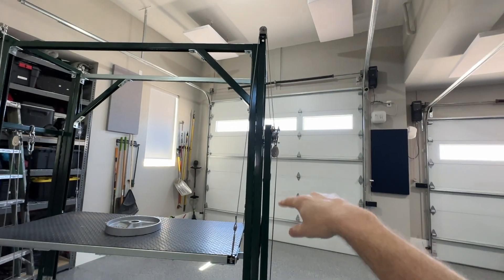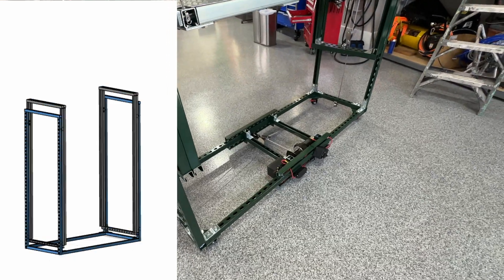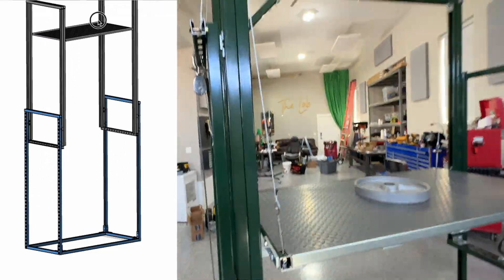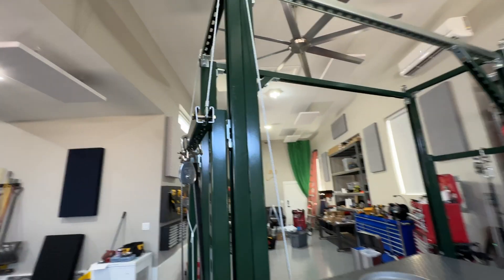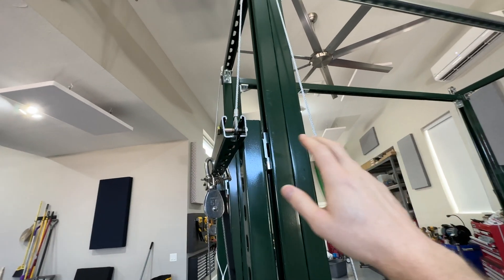It's just four strings on each corner that cause it to lift. I did build this in CAD before I started buying parts, just to make sure that it would actually work out — there were a lot of kinks to work out. Something cool I noticed is that it's actually all supported on one bolt per corner — four of those total — and all the weight is on there. It is a grade 8 bolt; I did the math, and it should be able to hold all the weight I'm going to put on it.